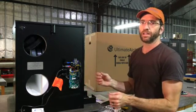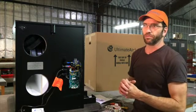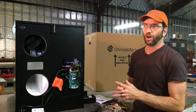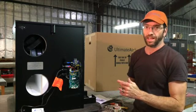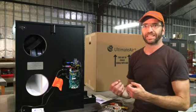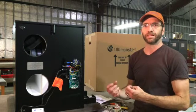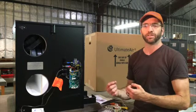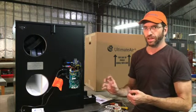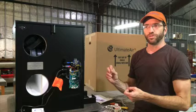Blower two blows stale air to the outside. The unit from the factory has the capability of flow control, meaning delivering the same amount of air into and out of the house. As a standard feature, you can also offset those airflows more or less in a permanent fashion — say 20, 40, or 60 CFM positive — so the machine would automatically bring in 20, 40, or 60 CFM more air than what it takes out.